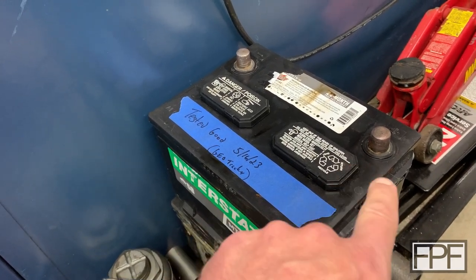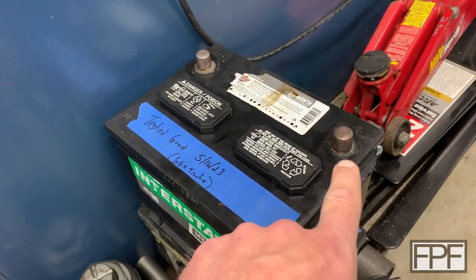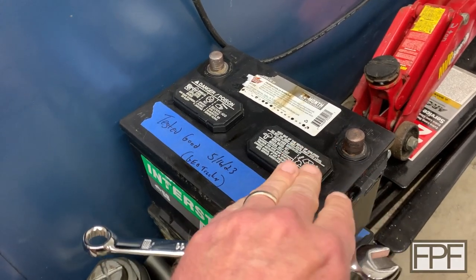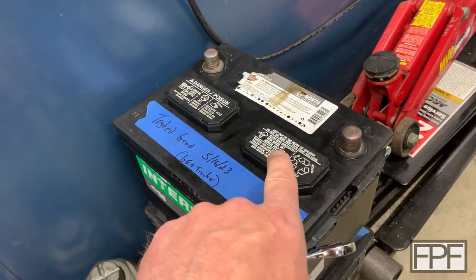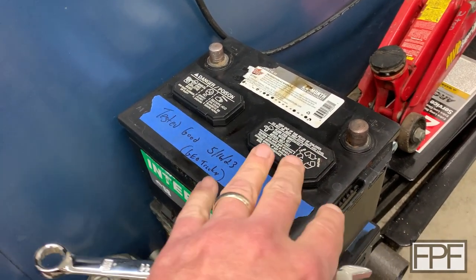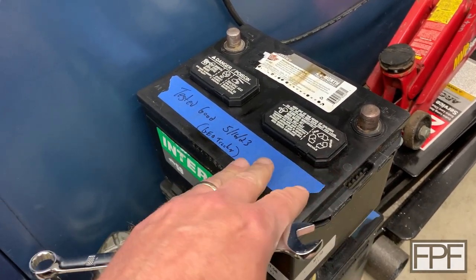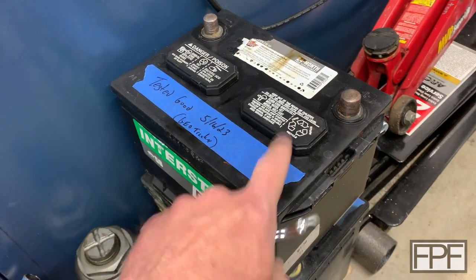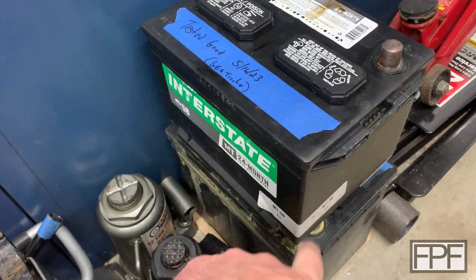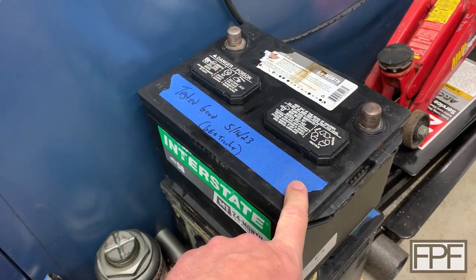What I'm thinking is we'll probably do red and black, just something that's a nice tight fit that goes down over these terminals and will stay on there even if we pick the battery up and move it around, but that's still easy to get off because I do maintain these batteries. Every couple of months I'll plug them into a charger so they stay fresh. The worst thing you could do for a lead acid battery is just leave it sit for years — it's going to go flat. You might recover it, you might not. But these things are not cheap, probably $125 a piece to buy them new, so I'd like to keep them working but safely.